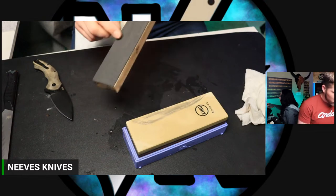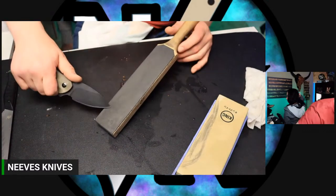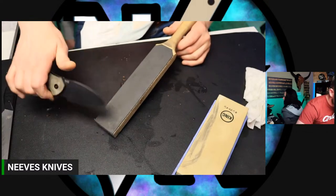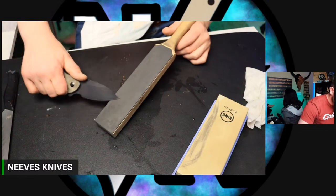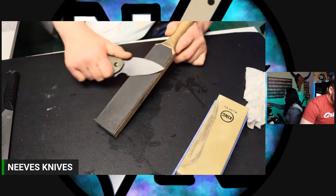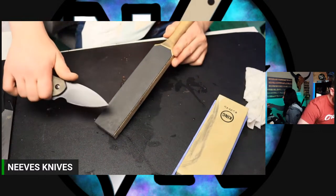I got it back. This is 12 micron gunny juice on this. You can see right here, I have it sitting over here, 12 micron. And because the stone I came off of was 800 grit, I jumped to the 6,000, but only to take the burr off and refine the apex a little bit, not to sit there and refine the whole scratch pattern or anything. So what's a good micron for diamond emulsion if you're only going to use one? Six. Okay. Between six and nine.